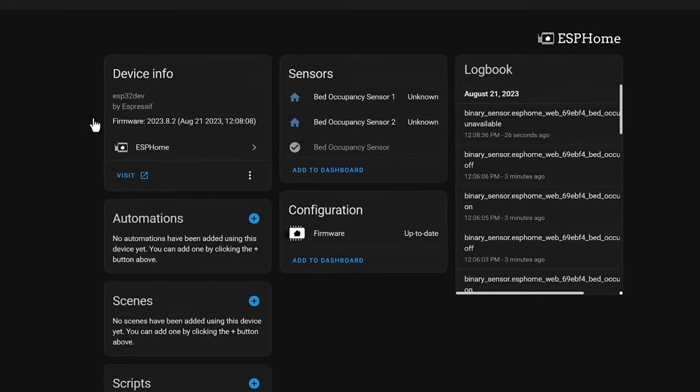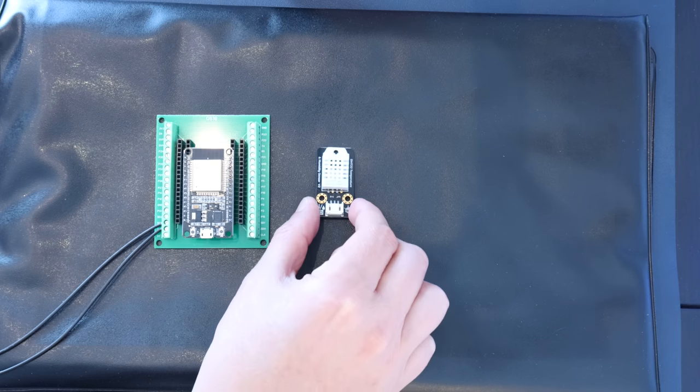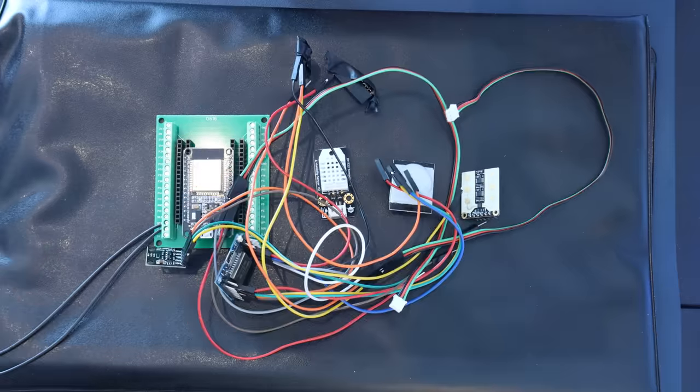The beauty of the ESP device is that you can wire in a second pad to the ground pin and another GPIO pin — in this case I've chosen pin 12 — and you can copy and paste the configuration from the original sensor to create a second bed sensor for the other side of your bed. Just update the pins and make sure that each sensor has a unique name, then re-save and install the configuration. You should now see two separate bed sensors in Home Assistant. You can actually take this even further and create a super multi-sensor by attaching temperature sensors, PIR motion sensors, and millimetre wave sensors all to the same ESP board.